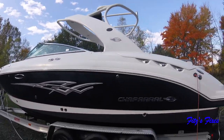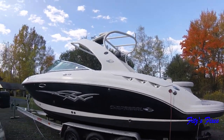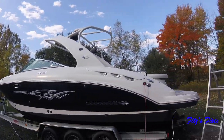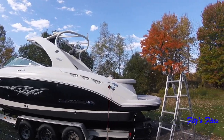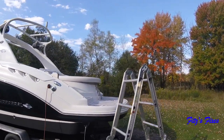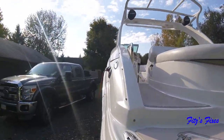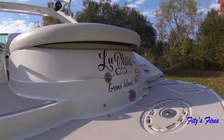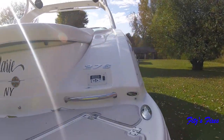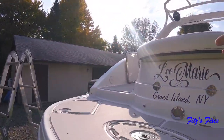And what we're doing right now is putting around the perimeter strap. Perimeter strap is basically going to be at the waterline, a little higher at the front, but basically at the waterline. Go around the boat like that, tie that off. I'm not going to include the swim platform because I'm doing a 28 foot wide roll. So I'm going to run another piece from this hook up over the top and then back down to here, so that way I can tuck the shrink wrap underneath it.